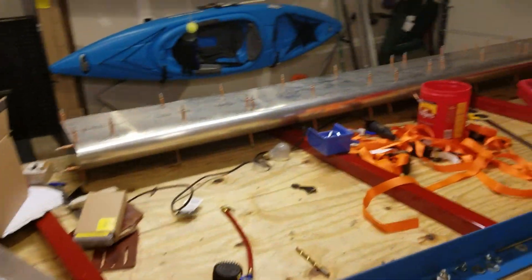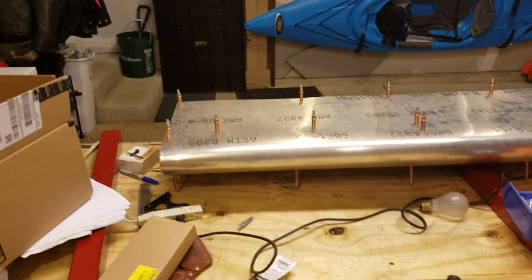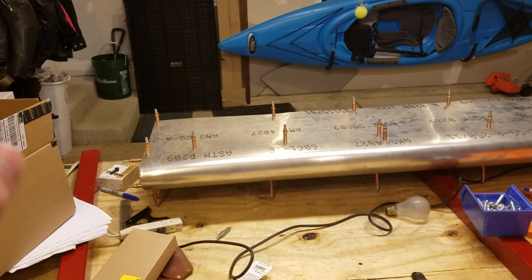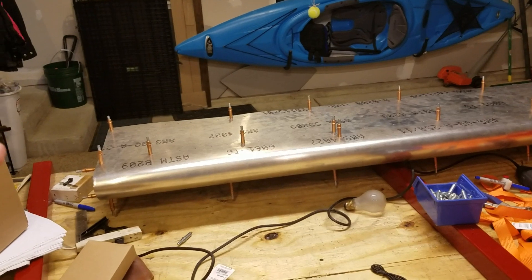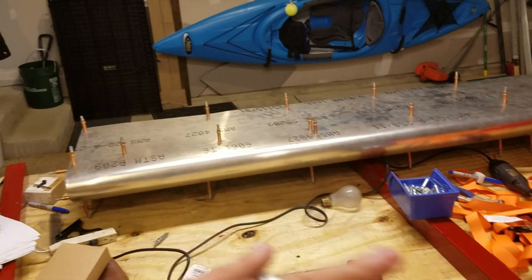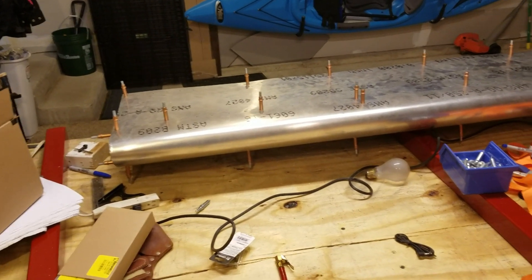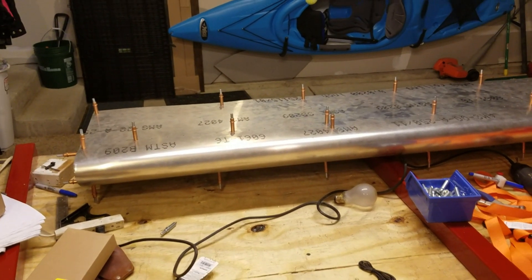I was working on the horizontal stabilizer and drilling hundreds of holes repeatedly. I'd start off drilling an A3 size pilot hole for the skin. Once I ratcheted the skin down and drilled an additional A3 pilot hole through the ribs and the structures underneath, I'd then go back with A4 final hole size and match drill everything. I got through one side of it okay without any problems with the compressor. A few days later when I went back, flipped it over and went to do the other side, I had a little bit better pace going on.